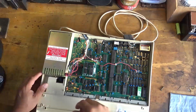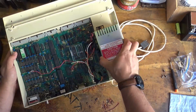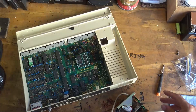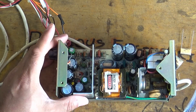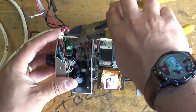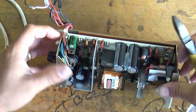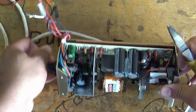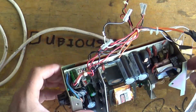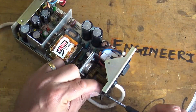The first mission here is to recap the power supply. These power supplies are notorious for going bang and creating a lot of smoke. It's the X2 capacitors on these power supplies that normally tend to fail. On eBay, for not too much money, you can find replacement capacitor kits for the BBC power supply - suits pretty much most of the BBC models, Masters and the Model Bs. The power supply is a bit of a fiddle to get into; there's a metal shell around the outside and a lot of nuts and bolts to undo before you can pull the circuit board out of its housing.